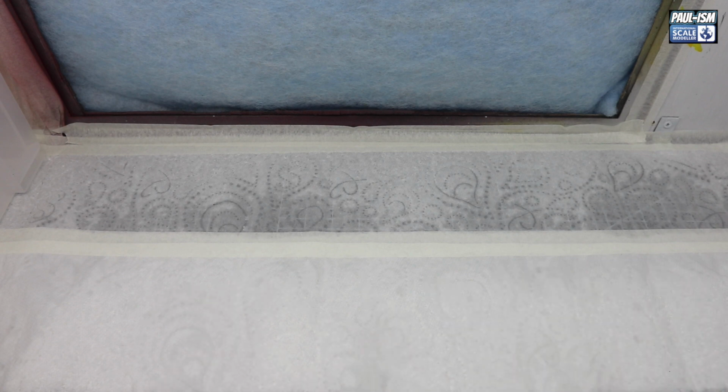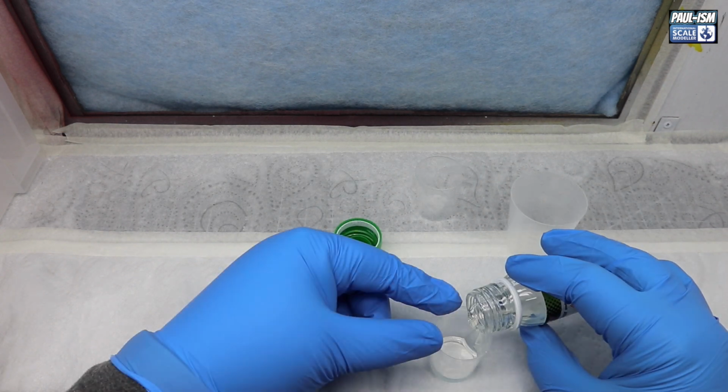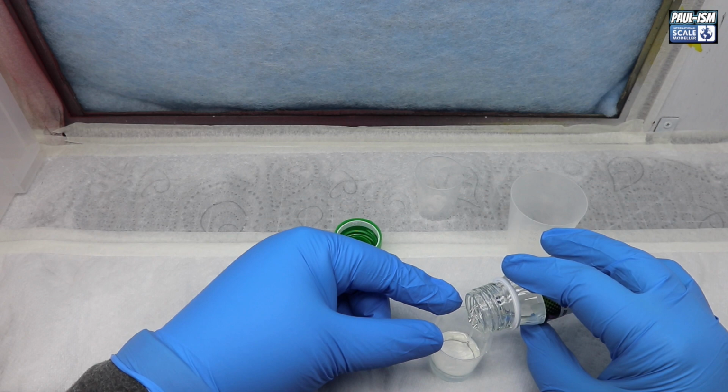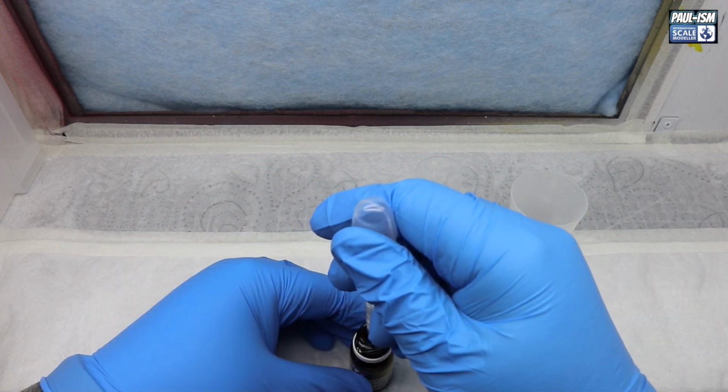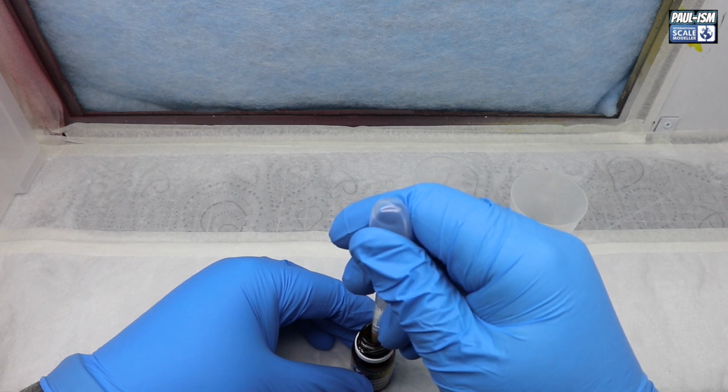Now, I always wet the surface. This is a fresh, cleaned out, empty spray booth. Everything's out of there. We've got fresh kitchen paper down. We've got a fresh filter in the booth. My room has been hoovered the day before. I've got double gloves on. I've got my arms covered. I've got my full face respirator on. And the window is open with this extractor going as well.